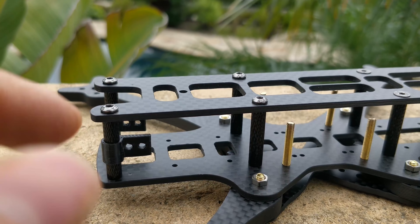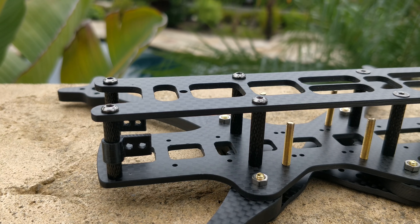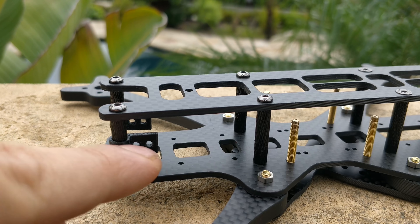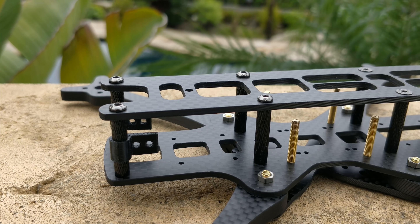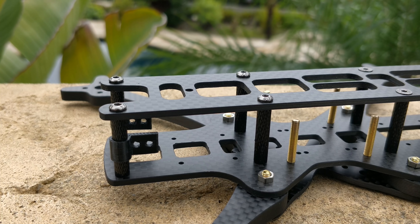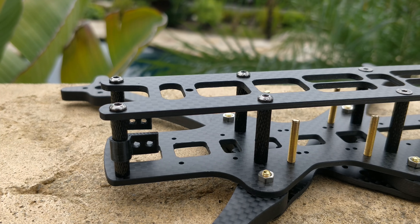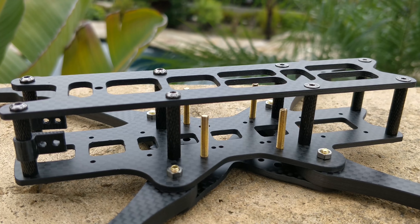I did add a little material here just to give it something. The main reason the holes aren't big enough to fit the entire screw head is related to the diagonal carbon fiber direction. You'll also notice the arms have nice thick wide butt joints against each other to avoid play in the arms. As you use the frame, you do have to thread the screws through the carbon completely, but the carbon will compress over time, and the butt joint helps keep everything tight and firm throughout the lifespan.